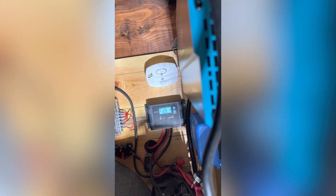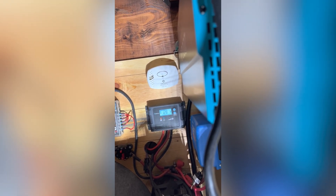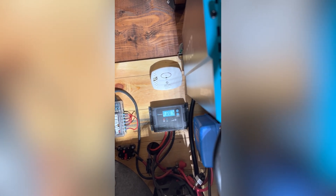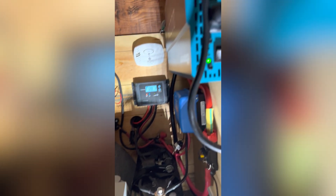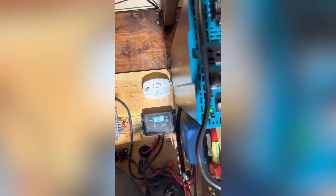That's a pretty high wattage draw, and that would be expected. So it has no problem running a high load and keeping the inverter on. But I do have to do that troubleshooting where I charge the battery after it goes into a low voltage state after not being used for 24 hours. At this point, I don't know if there's a dead cell in the battery, or if there's some sort of capacitor allowing a very high amperage draw at startup, which causes both of these to fail at the same time. But the inverter does work without any flaws if I avoid that initial undervoltage startup.